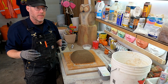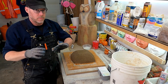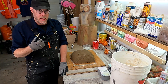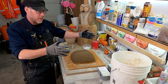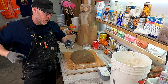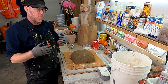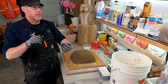Two of the most common ways I see people mixing concrete — and this actually makes me laugh, because I've done so much concrete mixing for decades — and I never do either of these. First: a square shovel with a piece of plywood. You often see this for a dry pack style of mixing — you put all your materials on a four-by-four piece of plywood and use a square end shovel to turn the pile over into itself over and over again. It's actually fairly effective, but it's still a laborious process.